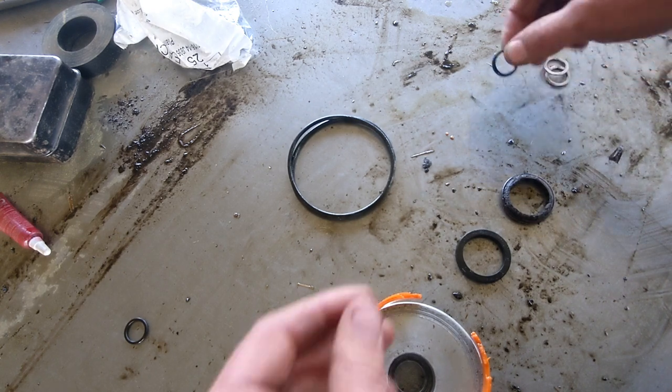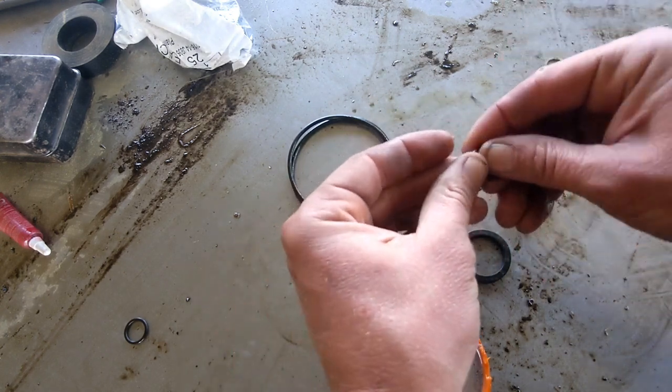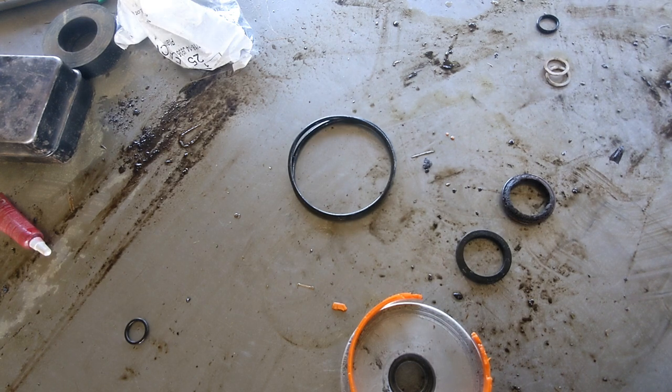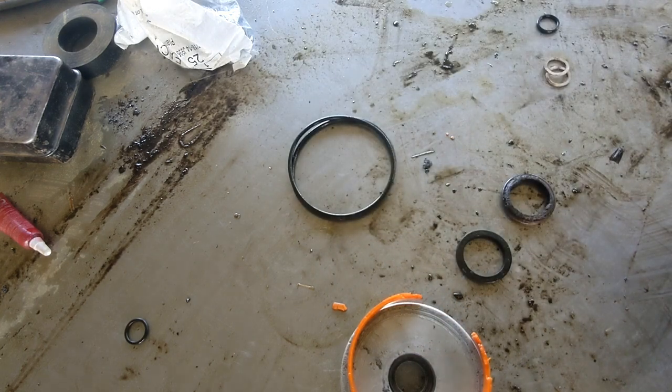And normally you would want your O-ring to have a bit of a compression fit on there. So that's probably like a 9/16 ID. Okay, so 3/32 and then 9/16. Like I said, I already wrote this down. So 572 is what I measured the other day. So we'll look that up and figure out, whoops, stay here, paper. Figure out what that is.